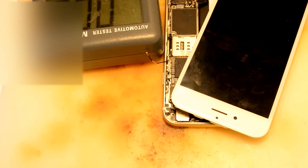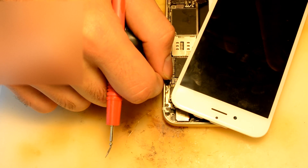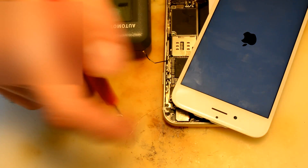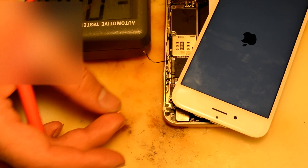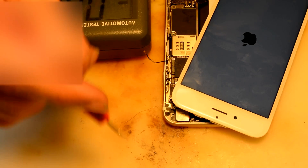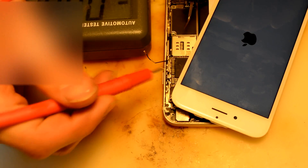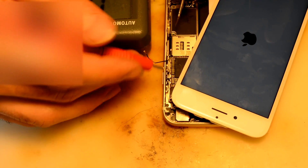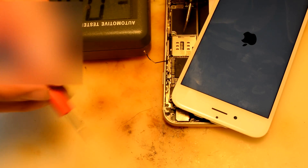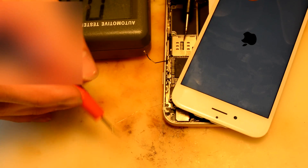I did the diagnostic on this one. There are a couple of voltages I'm missing, but resistance, as for me, is actually pretty good everywhere. Long story short — two voltages are missing. I put a jumper because there's no other way I can check the voltage underneath all those connectors. There are three main voltages. One of them is present — it's probably RAM, that's why it powers up. The other two are missing.